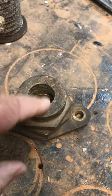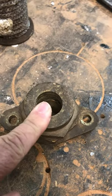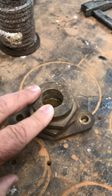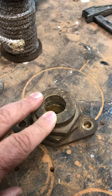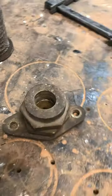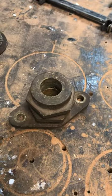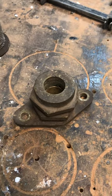The actual lubrication of this packing is water. So when it's properly adjusted, it will leak ever so slightly at rest. One drop every 20 seconds is nirvana — you won't get there, but that would be the frequency of the drips.